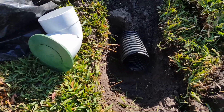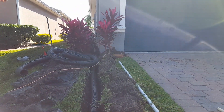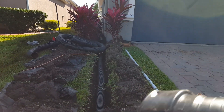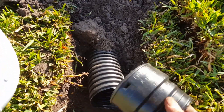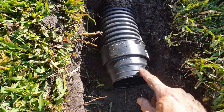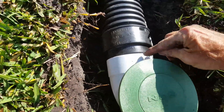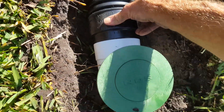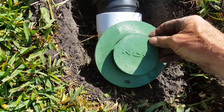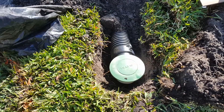Here at the end of the line is our pop-up. Everything is connected — the line goes all the way back. Gravity starts at the front downspout, the PVC comes in, and then it flows downhill. To put your pop-up on, we got an adapter here — it snaps in place with barbs. This adapter is tapered and slides right into the four-inch 90. We'll put a set screw in there. As water comes down the line it's just going to lift up the pop-up and disperse right out across the sidewalk.